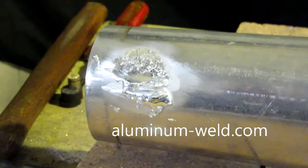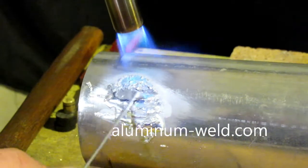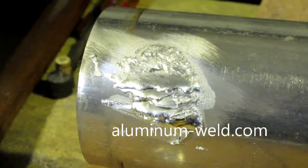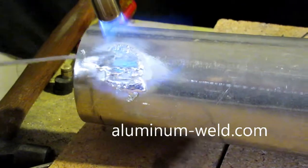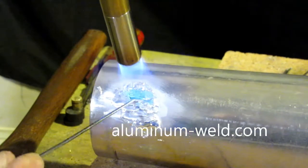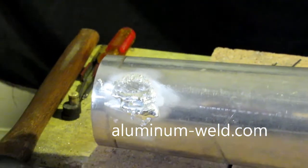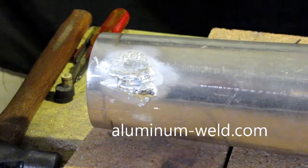I got it done pretty well — I'm going to put a little bit more on there. See, I started at the bottom and worked that sag up, just adding rod to it. I got a good thick layer on there now — that took about half a rod. I'll put a little bit more on it. We're going to take a hammer to this and see what happens. Let it cool. When you cool it, it's got to slow cool — do not put water on it to cool it because you'll lose your strength. Now you can grind that down and make it look nice, and then we'll take a hammer to it and see what happens.